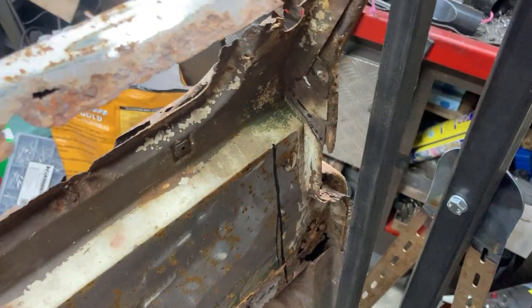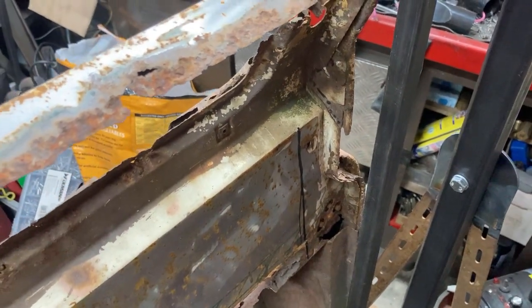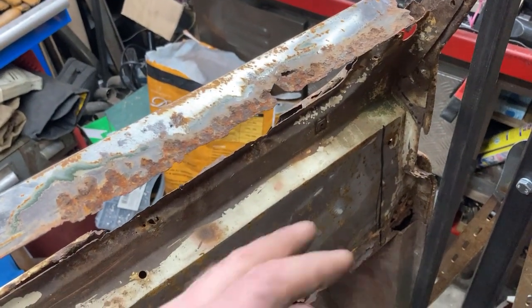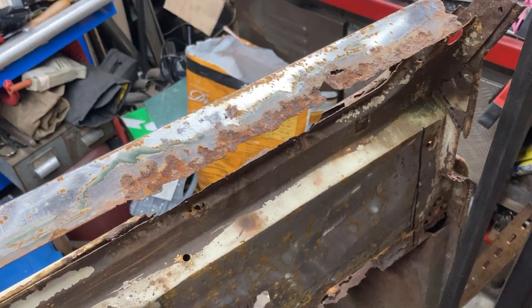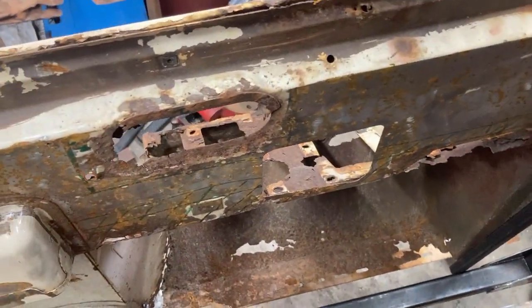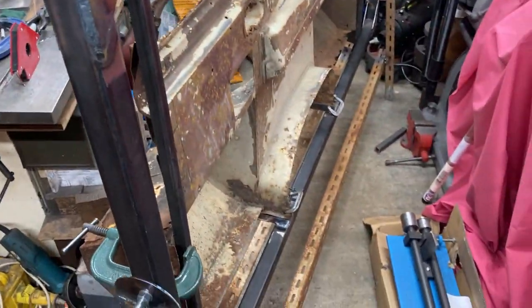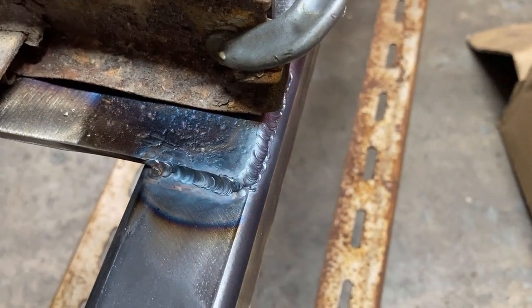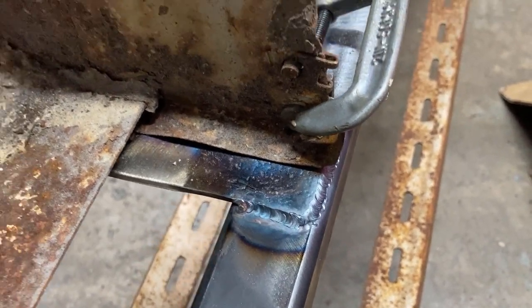At the moment I've just got some 20mm box section clamped and pinned on the edges of the footwell. I can't do it on that side because this one's missing all its top frame here. I've got a straight line up the edge of the footwell onto the frame, but on that side that one is failing all of this. So I've got a bit of jiggery-pokery to work with there. I want to make up some decent bracketry which, once the footwells are on, picks up off the footwells and everything works to that — they're going to be the most solid portion on the bottom half. So that's my plan. Right now I'm cold — I'm going in for a cup of tea. Look at that — stacking tight dimes, tight dimes — yeah, that's the word.